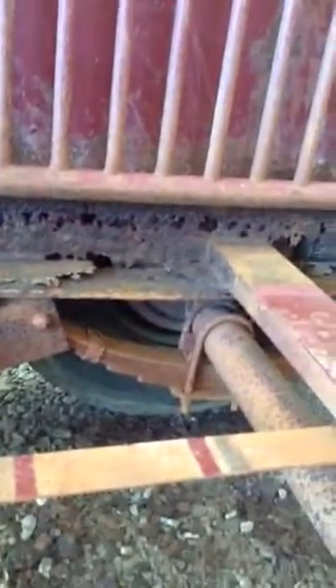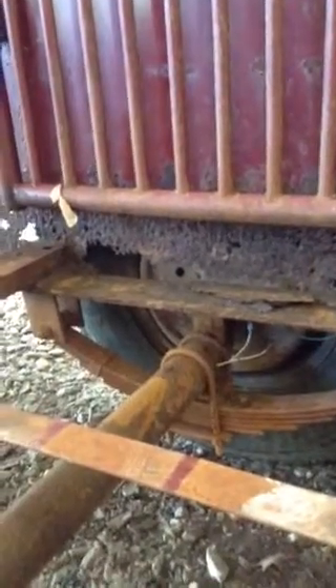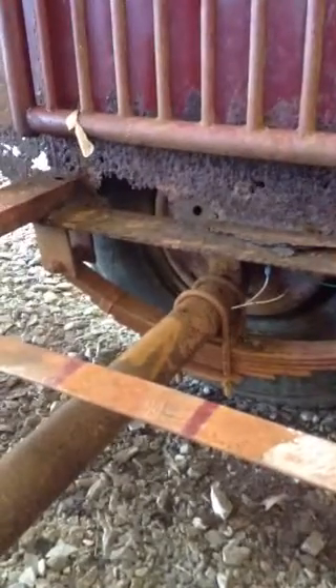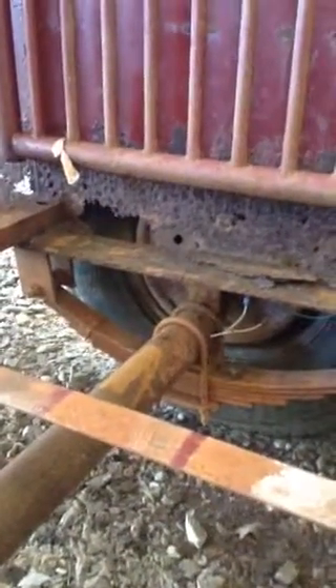To save time and avoid the risk of not lining the axles back up right, I'm thinking to just put flat bar or angle iron on top of there. This is a stick welder I'm going to be using. Feel free to comment on what you think the best rod would be — we've got some 6010 or 6011 and some 7018s back in the shop. Let me know whether 6010, 6011, 6013, or 7018 would be best, along with any tips or tricks.